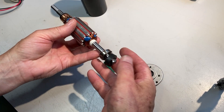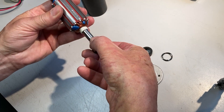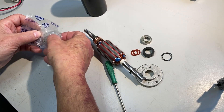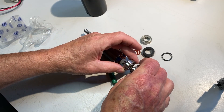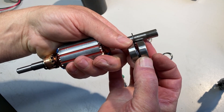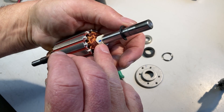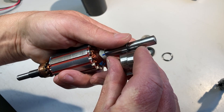There's a lot of fresh air at the front of the spindle here. What I've done is use a couple of Chinese angular contact bearings intended for lead screw fixed support. What I'm intending to do is have one of those either side of that circlip. I can't find any other way of actually constraining the thing — that's just a former that the armature is wound on, so I'm leaving the circlip in place and putting these two on.